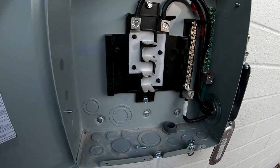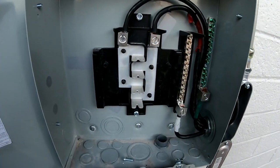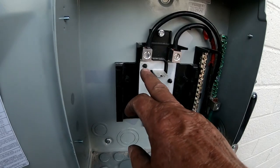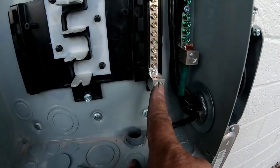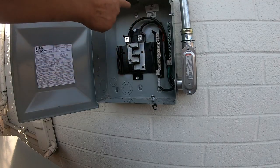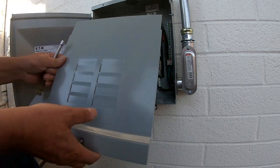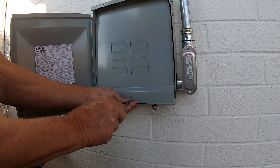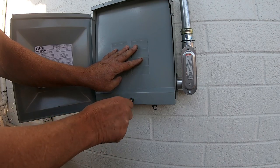Sorry everybody — my battery went dead. I wanted to show you how I came out of here through here and hooked up the ground, the common, and the two hots, but the battery went dead and while I was waiting for it to charge I just started wiring everything. So I put in the hot wires — here are my two hots. I've got my white common, isolated in plastic, and my ground over here on the side. Now that I have all this wired correctly, I'm going to put the panel back on and then go wire the main breaker, and then this part of the video will be done. In my next video I will show how to wire from the subpanel to the hot tub, and then we'll get it all fired up and running.